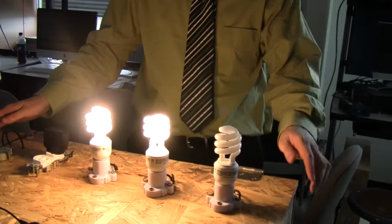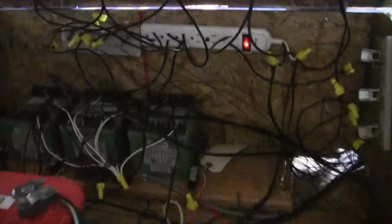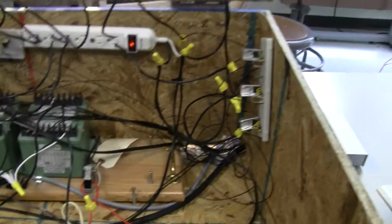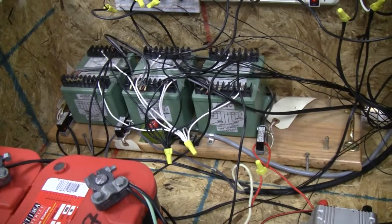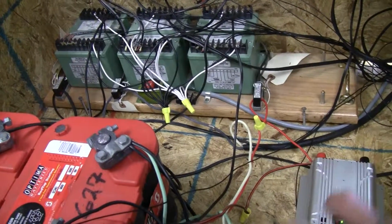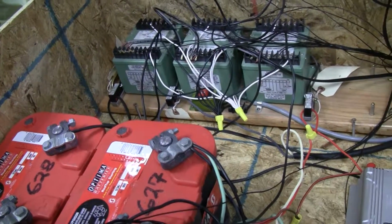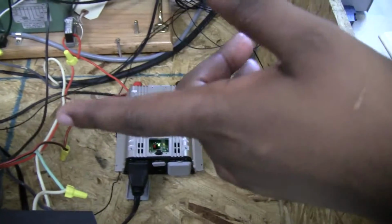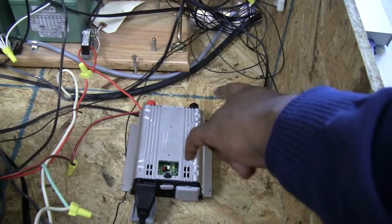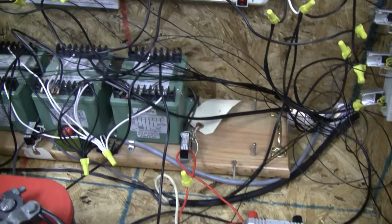Is this a battery box? Yes. Like some batteries underneath of it? So basically, to do the DC switching, we use MOSFETs. And this MOSFET, basically, we draw 4 volts and then it turns on, and if we remove that, it turns off. We're actually drawing 5 volts, but then from basically that's hardwired into the line of the inverter, so it basically doesn't allow it to ground.